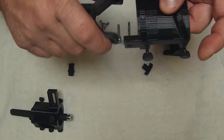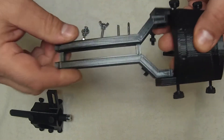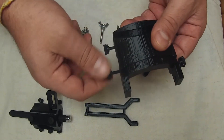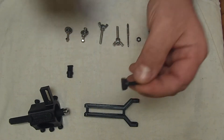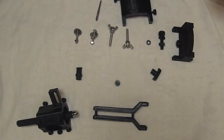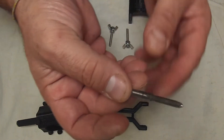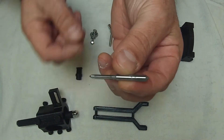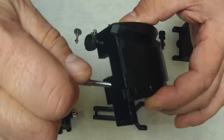There are little wings on this one as well, like on the azimuth mount, so you can mount this extension arm in various orientations. The purpose of this was to have a laser pointer able to shoot through the tiny hole in the XOS mount. The knurled screws are 4mm hex bolts, and the holes are included in the print but they should be tapped to make them really easy to use. So here's a 4mm tap — I'll show you how to do it.